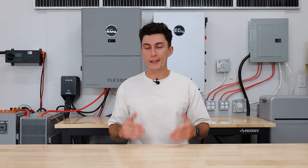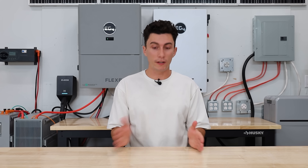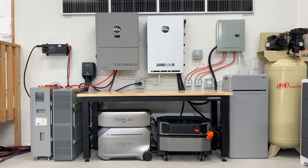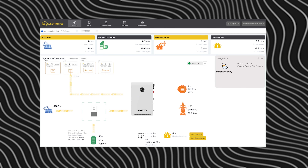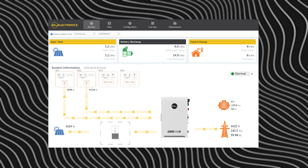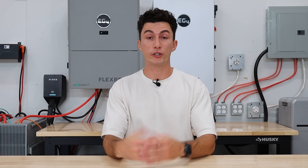To get them to turn back on, there is a 5% variance. So if you have a turn off at 85%, you can't have a turn back on within 5% of that — in our case it would have been 90%. They do this so that if you have varying solar coming in and out to charge your system, and your batteries are teetering at 85%, you don't have your EV charger clicking on and off repeatedly. It'll just wait until you're getting a nice constant charge. We had ours set to turn back on at 90% and 92%, and as we're getting power going back into the system, as we pass those thresholds, the smart ports turn back on and everything in the garage comes back to life, which is really cool.